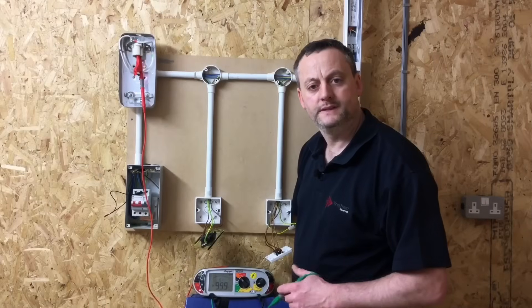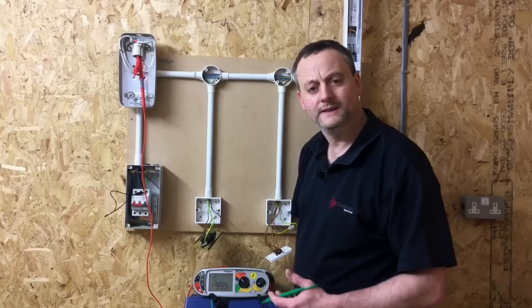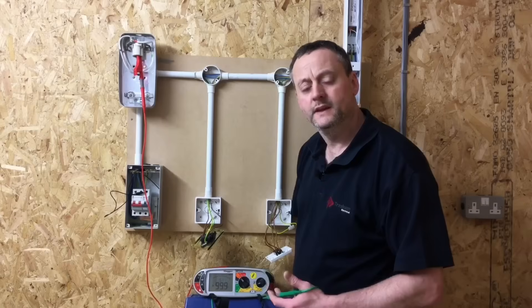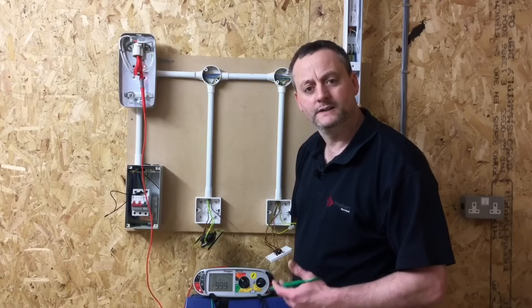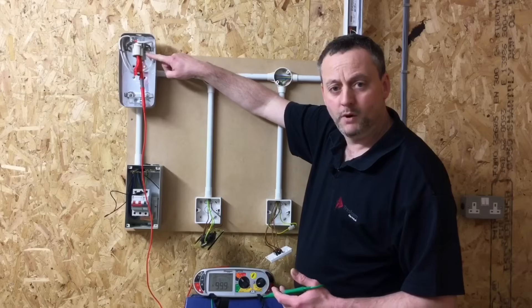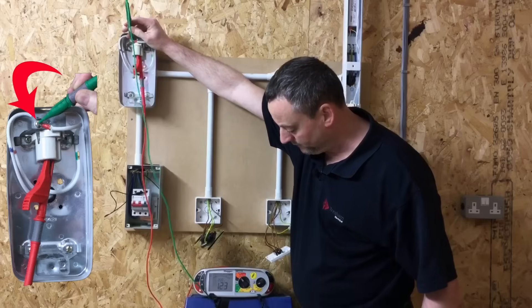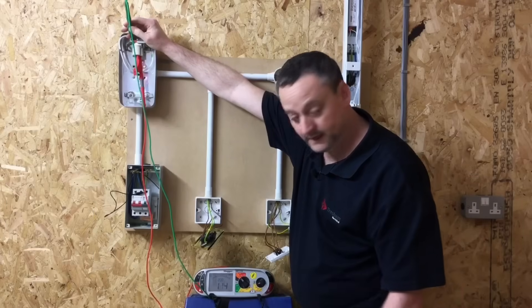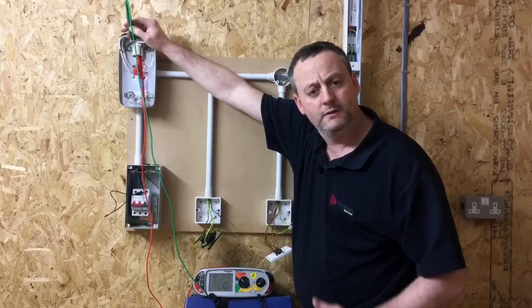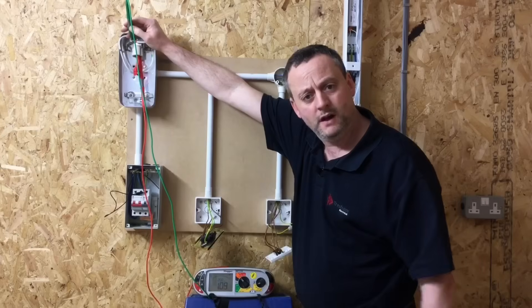We're all set up for continuity of the CPC — remove the resistance of the leads, instrument set to ohms, and we're ready to perform that test, as I've shown in other video presentations. This is all about proving that the exposed conductive part is connected to the CPC. I've linked onto my switching line within my bulkhead fitting and taken a first reading by going onto the position where the CPC was fitted — we got a reading of 1.14. We'll go through our switching sequence and see that reading change, looking for the highest reading depending on how many strappers are in circuit.